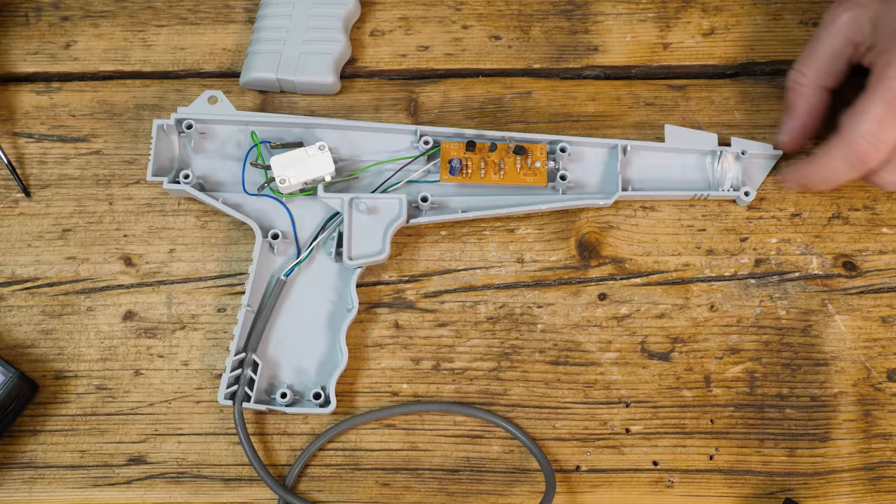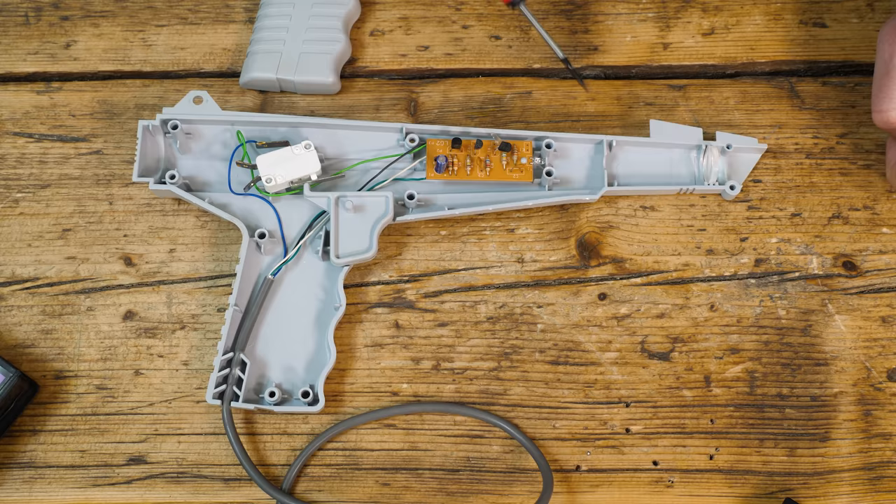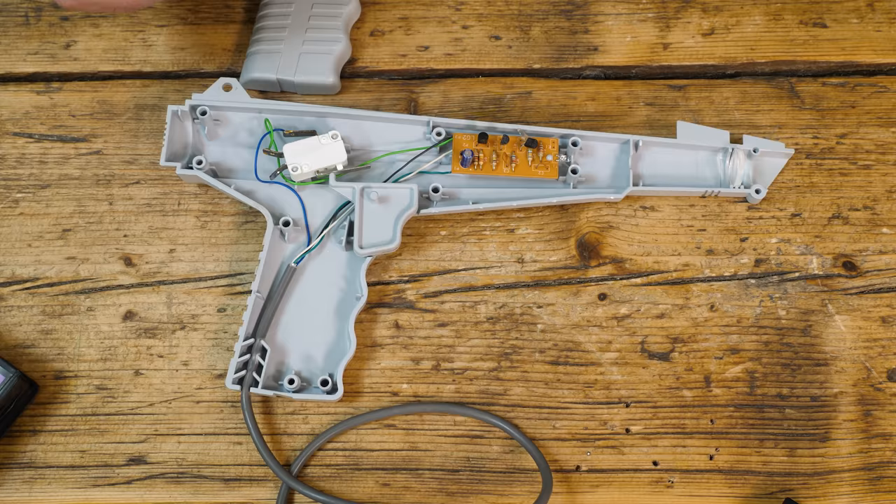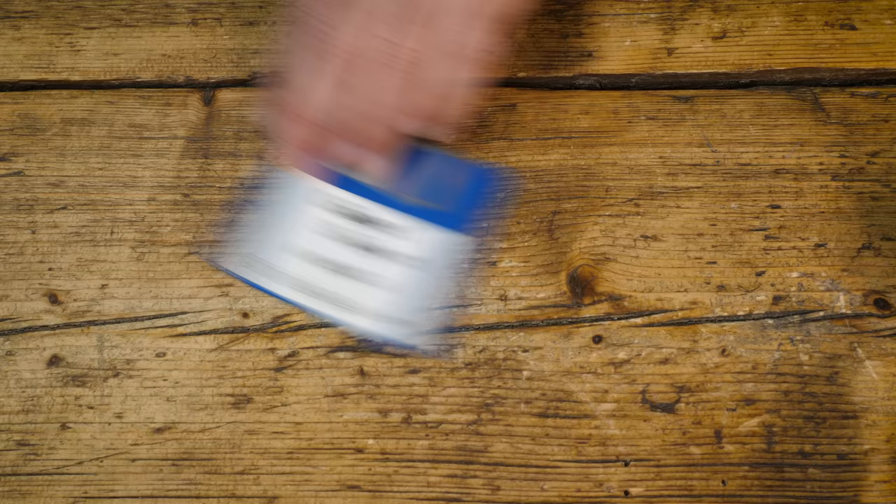But we can look inside our Amiga light gun, and you can see it's very simple — very little going on in there. We've got the trigger, which activates the micro switch, which tells the photo transistor to do its thing via the lens. That's it. It's really that simple, and that's why they could be sold pretty cheaply. I think this one was £29 when it came to market.